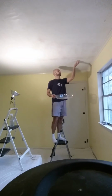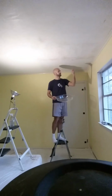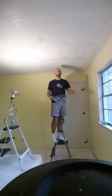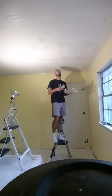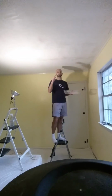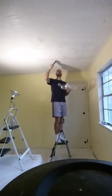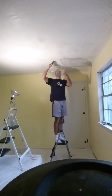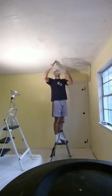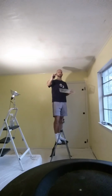But now, if I take my fingernail and just scrape it, it comes off underneath my fingernail real soft. It's not very hard anymore. And the important thing about scraping is a consistent angle and consistent pressure, the force that you apply. So you want to scrape and maintain a nice consistent angle. About 45 degrees is perfect.